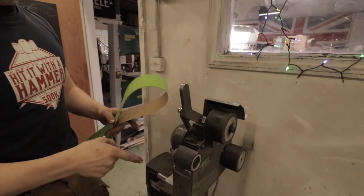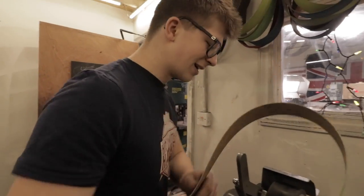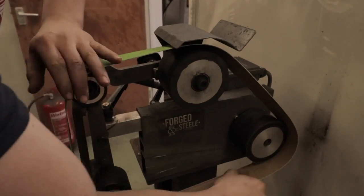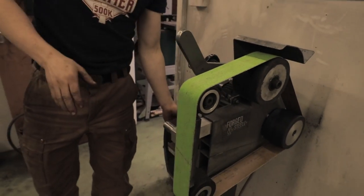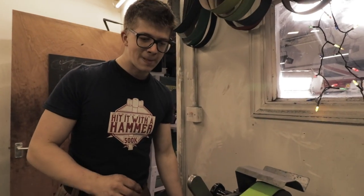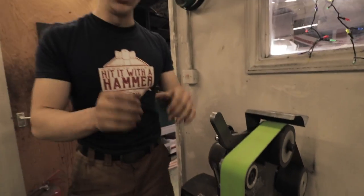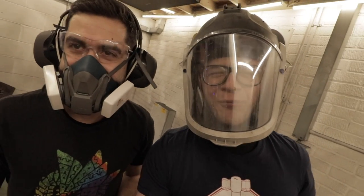You're going to be using this — this is a belt grinder. I'm going to start off with a 60 grit belt, which is coarse enough to take down the bulk of the material until we're through to true steel, past the oxides. We're going to run this thing really, really fast, but that's going to put a lot of dust in the air and it's also very loud. So you're going to want to make sure we wear a respirator to filter out all that dust so it doesn't end up in your lungs. Look at how safe we are!